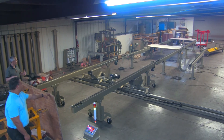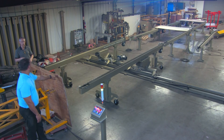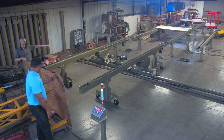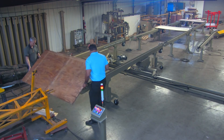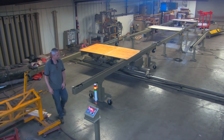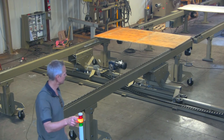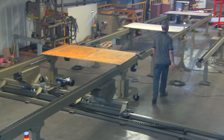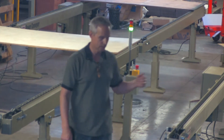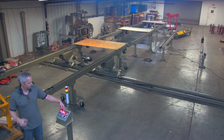Now would be the time where the operator says, 'I want to take this next panel and transfer it to the end — I don't want this conveyor talking to any other conveyors.' So you punch the start button one time, and that button can be pressed any time prior to the panel reaching the end. All three conveyors are indicated as full and this conveyor is clear to send. Once it lines up with the next conveyor and communication is resumed, it will unload. The flashing light indicates the command has been buffered.